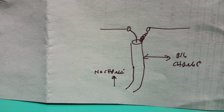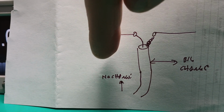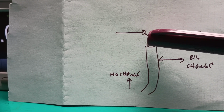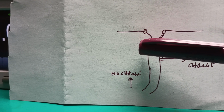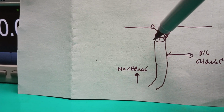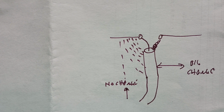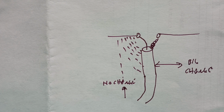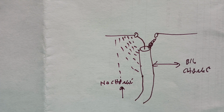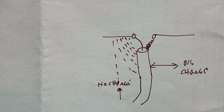What this shows is that the coupling to eventually end up over here coupling with the ground begins right here. It begins as that wire comes out and starts going this way. There's field coupling between here and here, like such, between the wire and the outside of the cable. In other words, the wire and the charges on the outside of the cable, the shield. The lines of force don't couple into the coax, and they don't couple to the other side of the shield on the inside. They couple to the nearest surface.